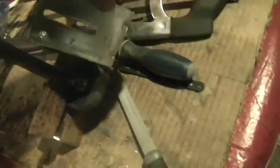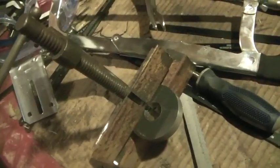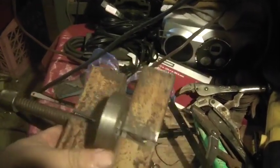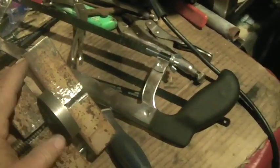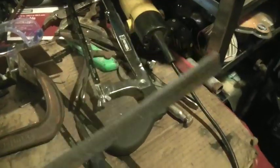You can see that side's a little chewed up — it's clamped on. Once I had the angle iron straight and I got this key and made sure it fit in there properly, the trick was that it is so long from here all the way to the other side — that keeps you from going all cattywampus. You more or less have to go fairly straight back and forth. Then I took my hacksaw, took the blades off, put it inside the donut, went back and forth and got a lot of the material out of there, then finished it off with a file.